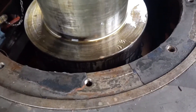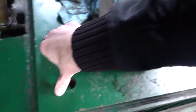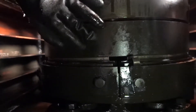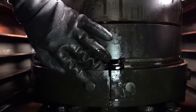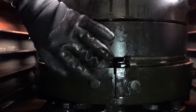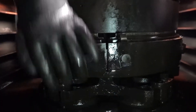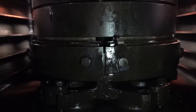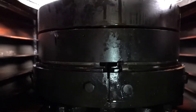So this is the thrust bearing up here. This piece here is what we call a top hat. That gets pinned to the shaft so it can go down. This is basically a big, giant thrust washer. Underneath here are the pucks — you adjust your bearing as you need to, your pucks to float it whichever way you want. Babbitt, steel, steel, and babbitt again.